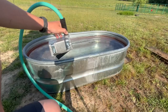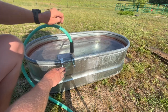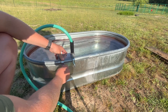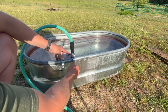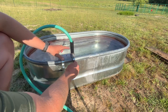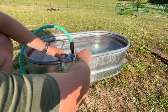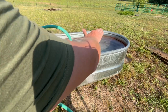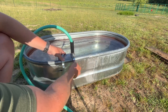Now we install it to the tank. As I'm threading this onto the side of the tank, if you look across the side where you see the water line, it's very important when you're putting these in that you set your tank in a level area — because if it's not level, water's going to be higher at one end and lower at the other. The directions state to always put the check valve at the end that has the highest level. If you install it at the lower end, it'll never fill up — it'll never build up enough pressure to actually shut it off.